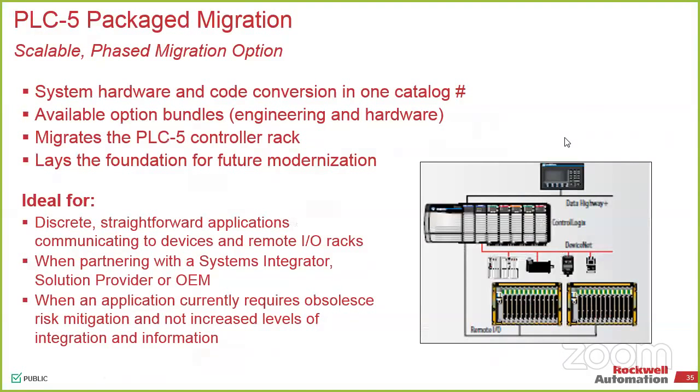If it's a 32-point and all the wiring is going in the same spot, it's the exact same thing. You just have to take the onus on the programming side to make sure it's making that addressing, because when you do the program change, you have to assign it to the specific card you're looking at. Yeah, because that conversion wasn't really able to assign the high speed component. So when you're doing the automated conversion, it's not going to do that. Correct, you have to manually do it. Yes, that's what we did eventually.